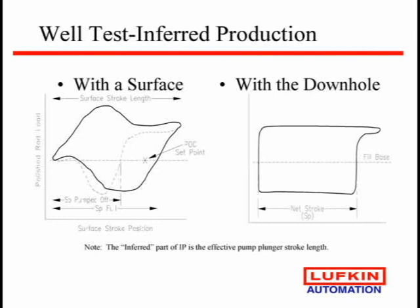Early on, most of us were all well workers — we just ran dynamometers. You'd show up at a well, maybe they told you what it made, maybe they didn't. So the first thing we'd do is grab a dynamometer card. Knowing the pump size, strokes per minute, and stroke length, we could estimate what the unit should be making per day. With the rod pump controllers, we tried to figure out the pump stroke by drawing a line near our standing valve weight — the weight of rods and fluid — and any time the card crossed that line, we called that our pump stroke. We knew it wasn't correct, but it was close, so we applied a K factor for calibration. Now that we have the downhole card, we can see what the real pump stroke is.